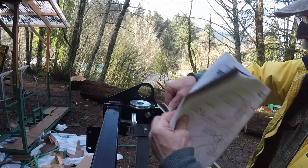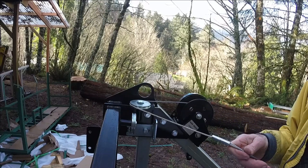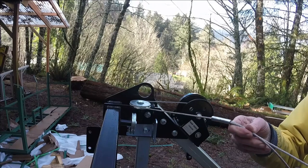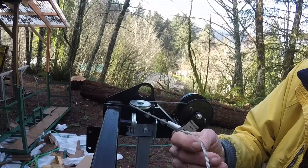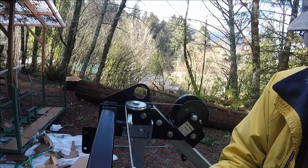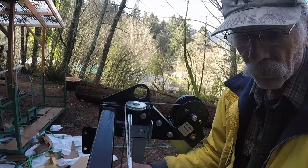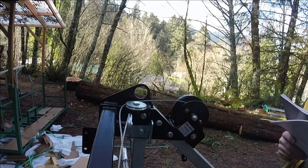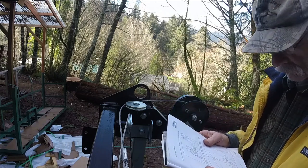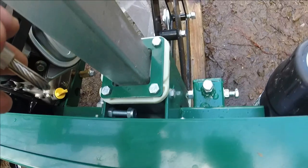We go around this. This short cable end goes straight down. Okay. Short and long. Long comes down and comes back on the rear pulley. The short is on the other pulley. Now what? Connect the shorter end of the lift cable to the bolt in front of the left front post. That would be that bolt there, because what the hell else would it be for?